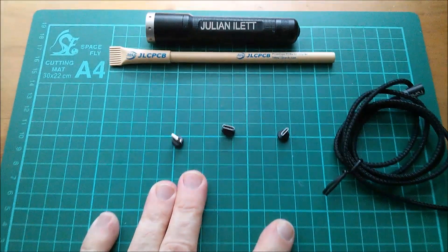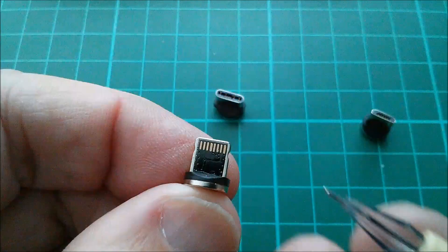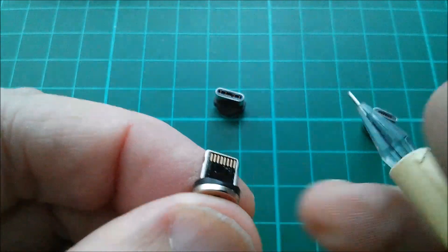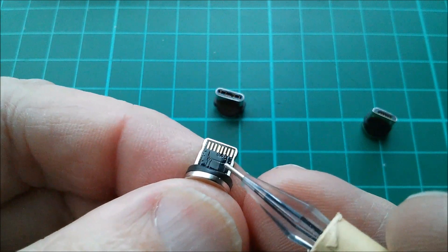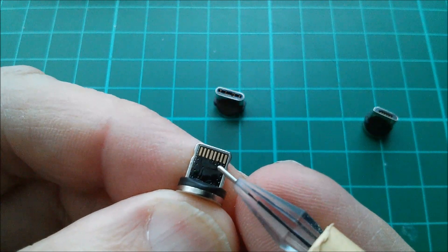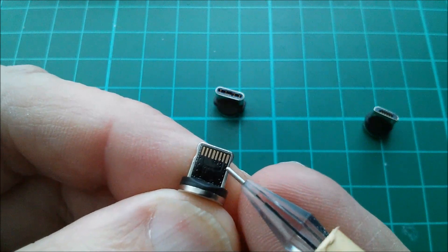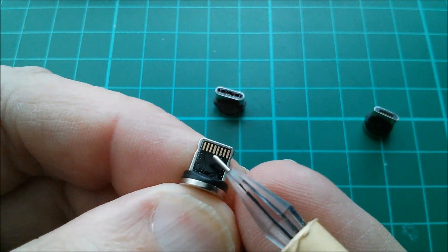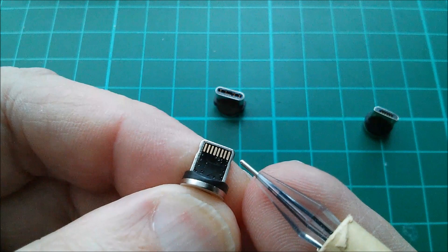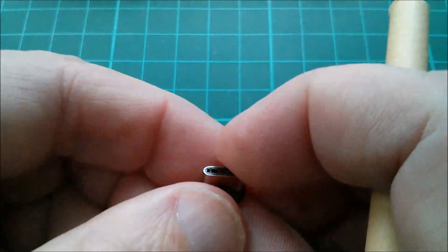Let's have a close look at those ends. The Lightning one has a solid metal end with some sort of embedded printed circuit board — you can see the tracks and vias, and the exposed, presumably gold-plated, contacts. They don't look like they've been implemented very precisely — there are differences between the connector positions, different widths between them. That looks a bit disappointing.